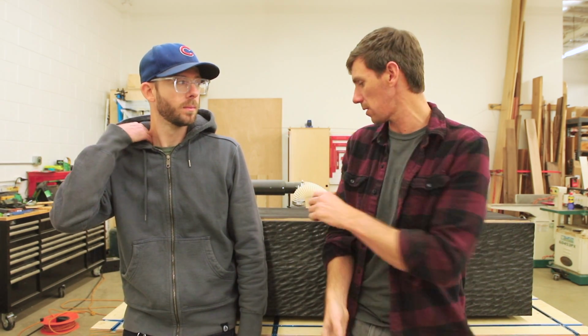Yeah, so it actually bowed up, concaved up this way. We tried to fix it, we flipped it over, we burned the back, hoping that would help pull it back straight. And that's kind of when we realized that carving in the scallop pattern probably weakened the front face and the wood grain and had it pull that way. So the idea then was to cut in some relief cuts along the back side of this door and then burn it again to hopefully pull it back flat.